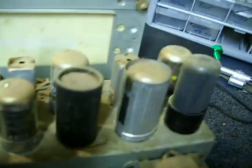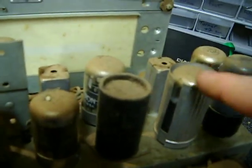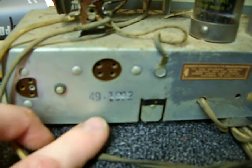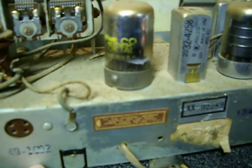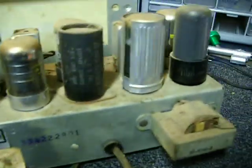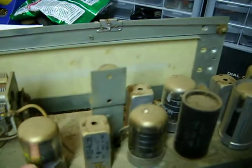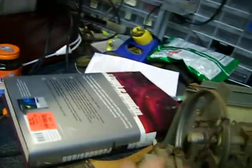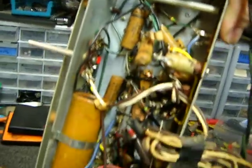Original tubes — RCA, I think this is a Philco, and back here that's a Hytron. I haven't pulled what's under here. It's pretty dirty. This thing is not believed to have been used since at least the 1970s, and it was made in 1949 — model number looks like 49-1602 or 1692. Basically it's just an AA5 chassis, five tubes. It's Philco loctal stuff instead of octal, but you've got one octal tube here. Very basic, not a lot going on — it's a large chassis but pretty simple.